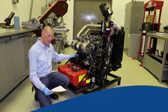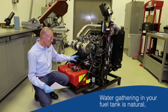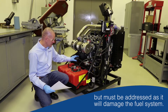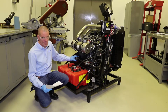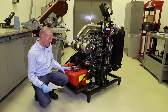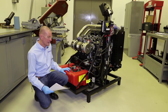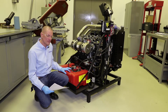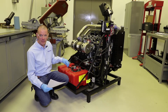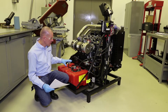So why does water get in our fuel? Well, it's a natural occurrence unfortunately. Water in the fuel is bad because it will damage our fuel system — very expensive. We need to make sure we remove it first. It's a naturally occurring problem because typically a fuel tank — sometimes much larger than this, sometimes made out of some sort of metal — is susceptible to condensation. We get condensation inside the tank and it ends up becoming mixed with the fuel.